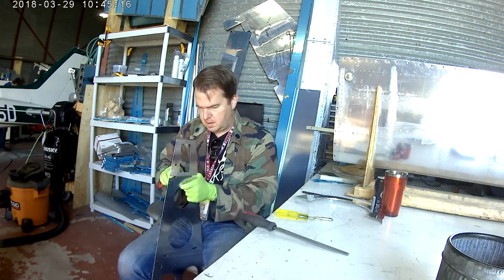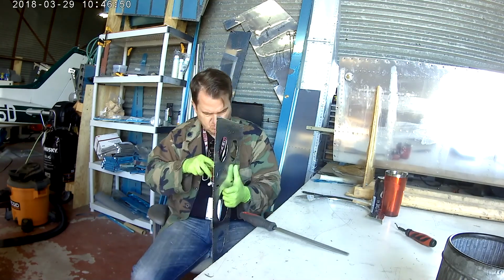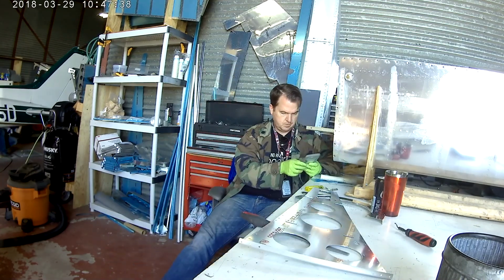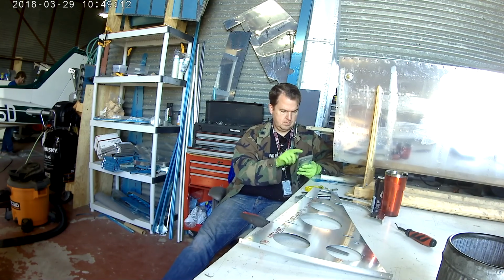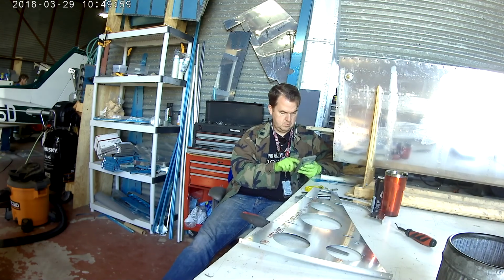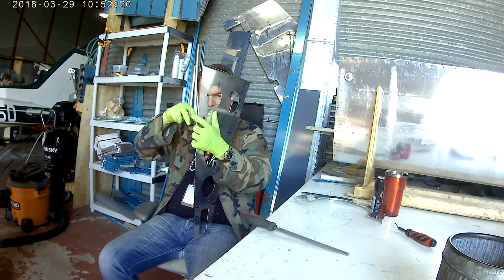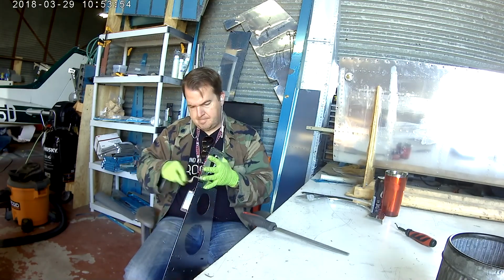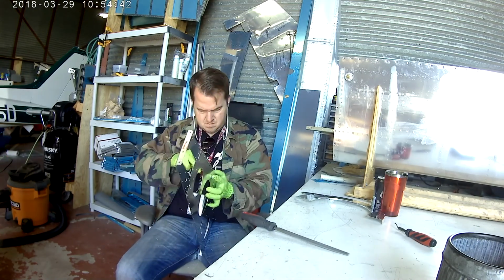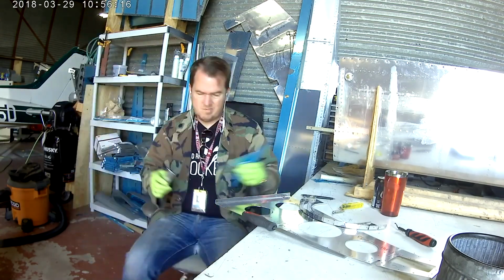That's also where you'll be mounting an ELT. I was going to mount an ADAHRS there, but I decided to just mount the ELT as Van's tells me to. Just going to shut my mouth and do as I'm told. And I'm also deburring, or you saw me deburr, basically the very top. It looks like a bulkhead top, but it's not. It goes to the very front edge of this back deck and grabs onto the very tail end of the top skins, which you'll see later.